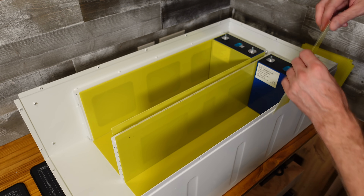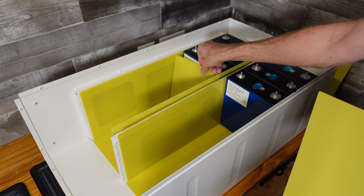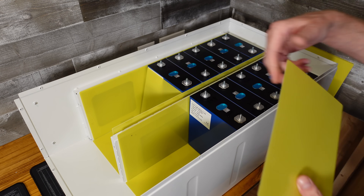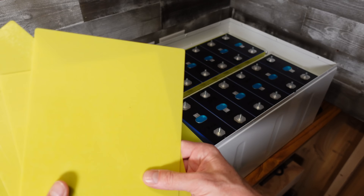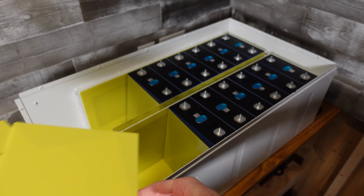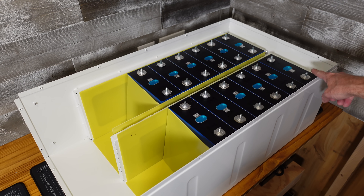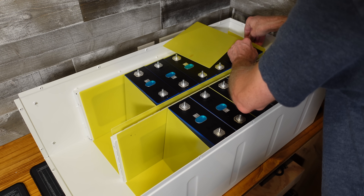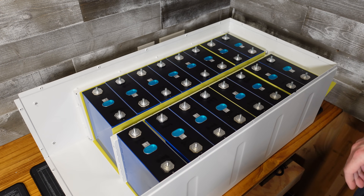We will have the positive up in each row for the first cell, then alternate polarity as we add cells with spacers between each pair. Partway through the build I realize that four of the panels are slightly thicker than the rest, so the four thicker ones are supposed to go at the ends — I need to swap out those spacers at the start and continue inserting cells and spacers until the row is complete.